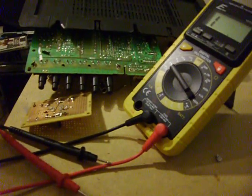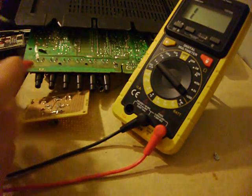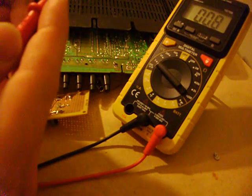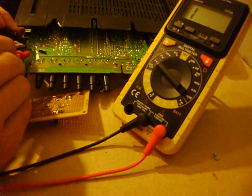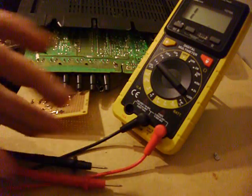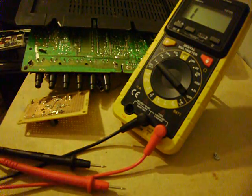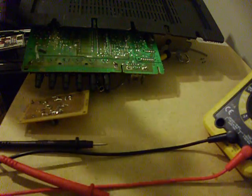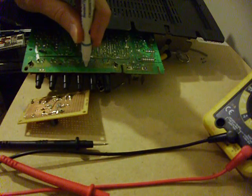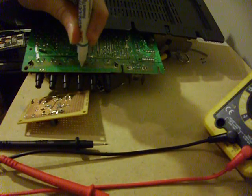To make sure the conductive pen actually works — I know it sounds strange but it's true — on the far right here you'll see my meter is showing that it's open and this is closed, and this is across what I just painted on. It has the consistency of white-out and you kind of have to plunge it up and down in order for it to work correctly. Once you get it started it'll kind of puddle a little bit and you just drag it along.